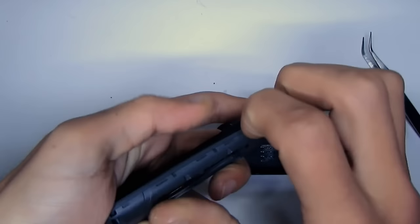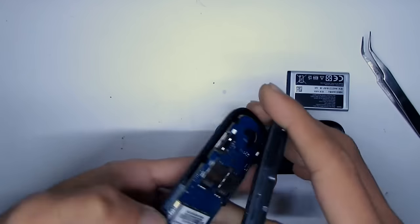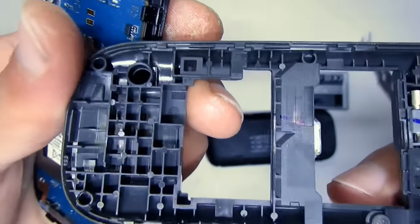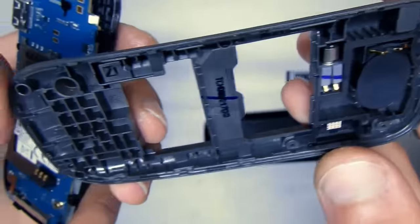But there are some limitations. First, not all phones support the QI standard. Second, although there is a universal module for wireless charging, they overlap the USB port. If you need to use USB, it is necessary to disconnect the wireless module cable. Of course, it's not very convenient.